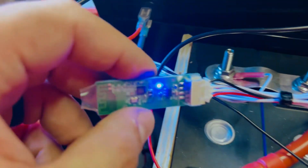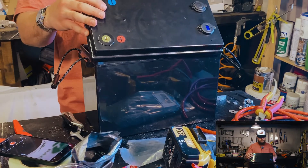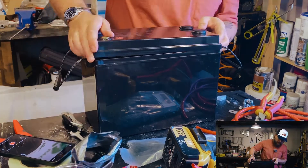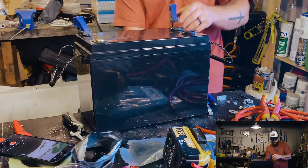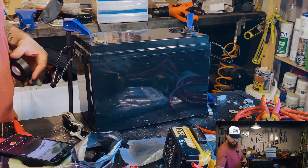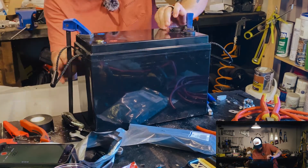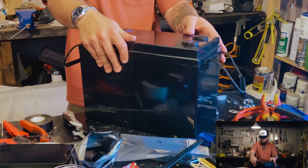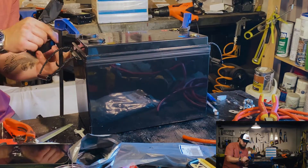We're going to close that up and check everything out on the app. Getting these cases closed can be a little bit tricky sometimes, mainly because we're trying to put a lot of stuff into a fairly small case - but that was intentional, we wanted as small a case as we could get away with when building out the OPS range of batteries for a true drop-in replacement size. The easiest way I've found is to lay everything out, position it so cables won't rub on each other, then use a couple of clamps and tape it up with electrical tape. That's how we did the prototypes for the OPS batteries.